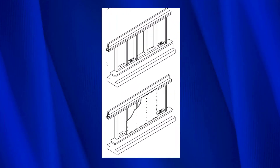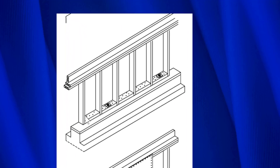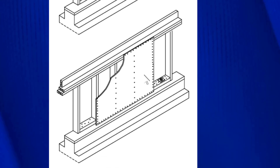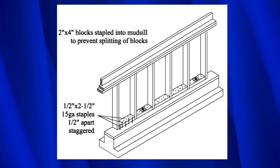Here's another method by which the plywood is attached to the bolts — that's with blocks. You see a block here between the two-by-fours, another block here, and these bolts go straight through the blocks into the concrete. When that's all done, we take the piece of plywood and nail it straight into the blocks. Remember, these blocks are made out of very low quality wood.